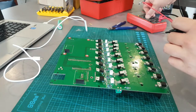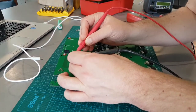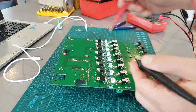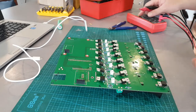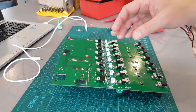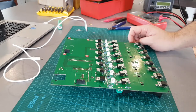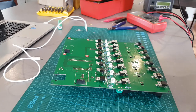Another thing to do is work it on ohms and see if you've got any ohms coming in - around two kilo-ohms. Some components will show some resistance on that plane, but it's a good test to see if you have any shorts between positive and negative before you plug it in. Because if you do plug it in, you're going to fry stuff, burn stuff, it's going to cost you money, and make it a lot harder to fix. One thing I can say: if you're not an expert at electronics and you're building this - do one thing, test it, do one thing, test it.